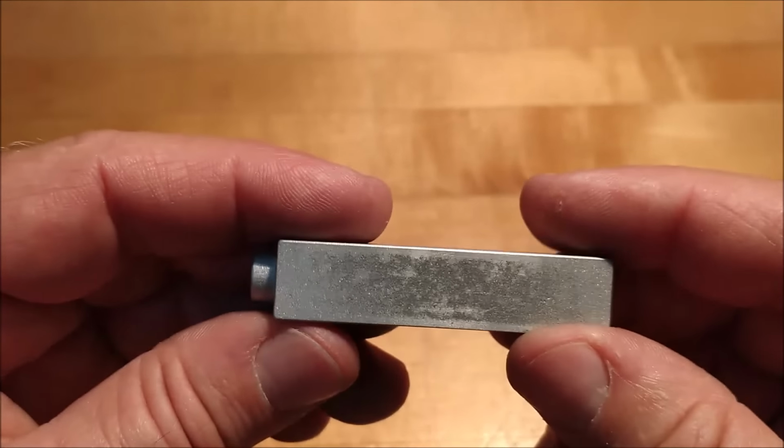And with the front and rear of the fly cutter, with the diameter set longer than the part, only the leading edge of the fly cutter needs to pass over the part. This should give a very fine finish on the top. With the part nested in aluminum jaws and the ends exposed, it was easy to bring in the overall length and the required height of the boss on the large side.